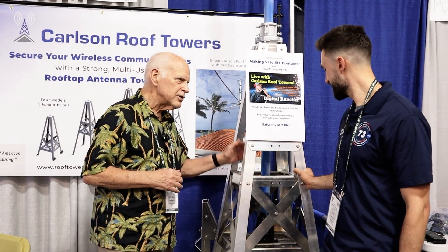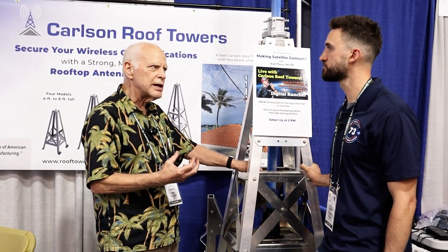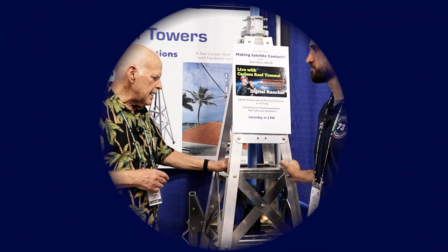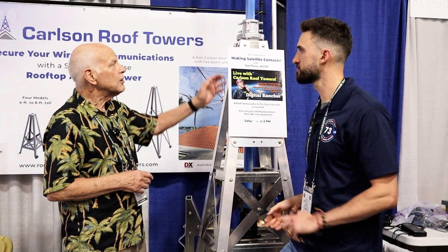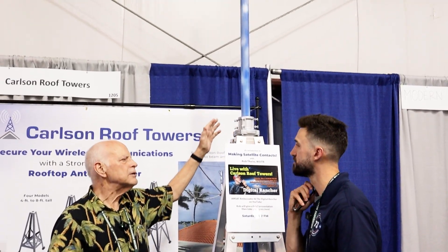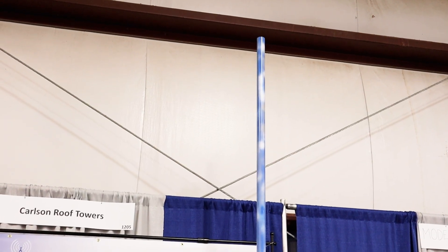This thing bolts into the roof — you want to go into the rafters. It's all about security. High wind — this is made for windy conditions, to last forever. Made of three-eighths steel and it's very strong stuff. It'll take a mast 10 to 12 feet above the top, depending on what's up there. It's all about wind load and the size of the antennas you're putting up.